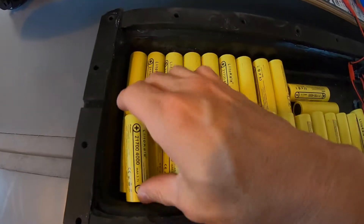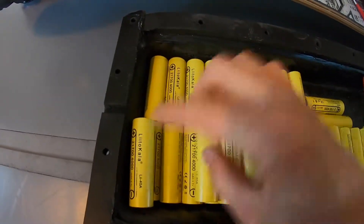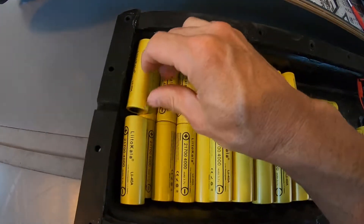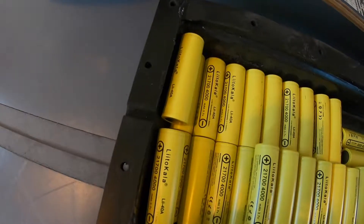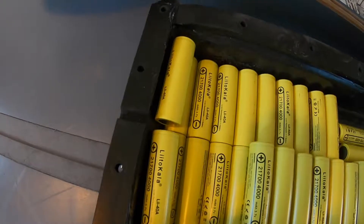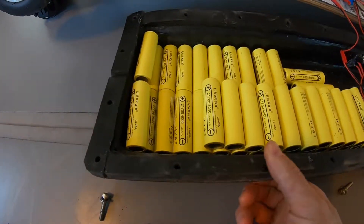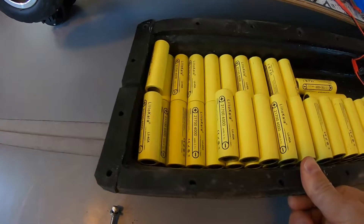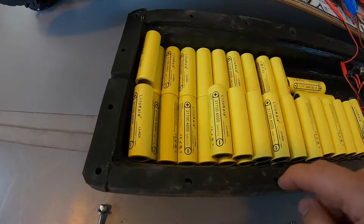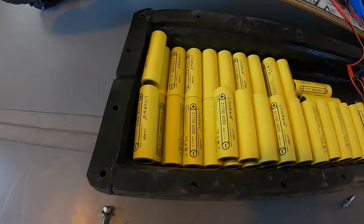That would actually mean that if you think about this cell being up here closer to where the seal is, and if this one's on the other side of the wall where the seal is, that's how much space I have to work with in between the two packs as I put them together. The nice thing about the seal I have here — this is like some 90 shore rubber — there is no compression whatsoever, so this gives my case a little bit of additional height.